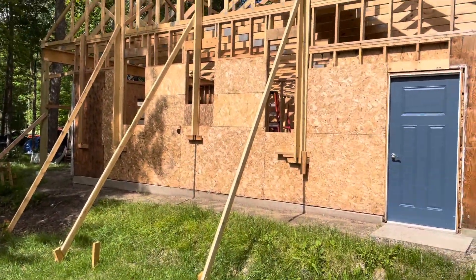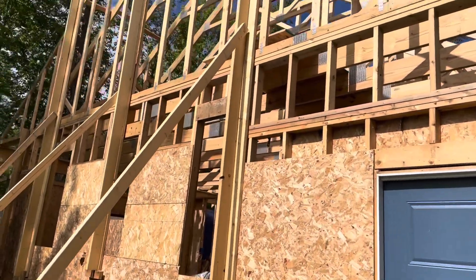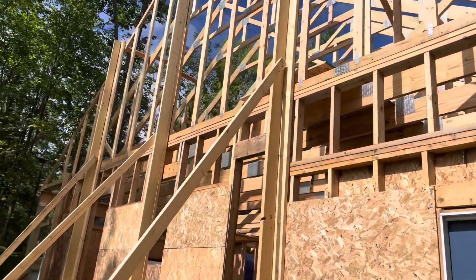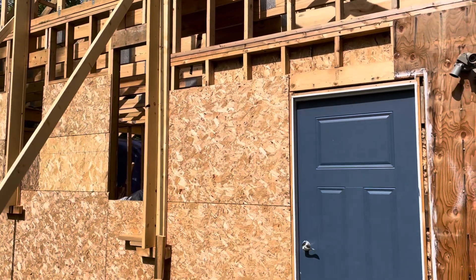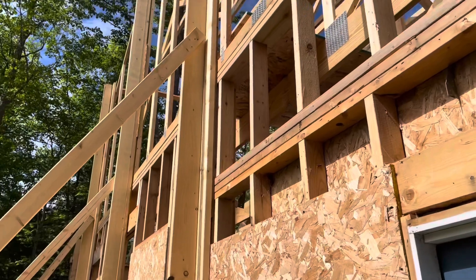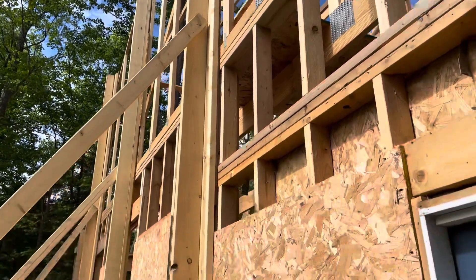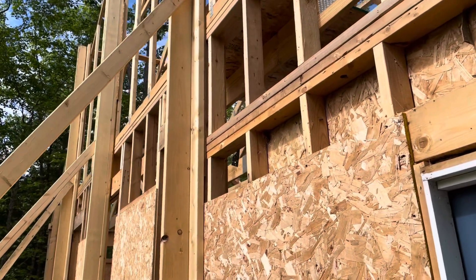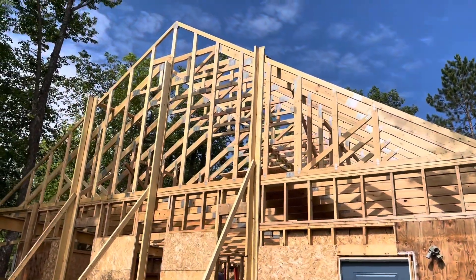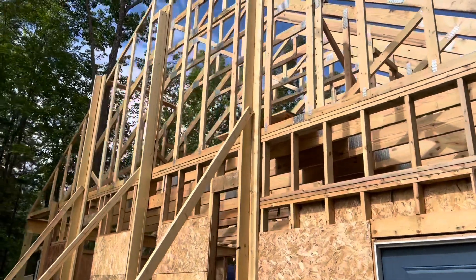Well before we were ready to set the trusses I went ahead and built these strong backs and put them up there. It's two two-by-sixes laid at 90 degrees to each other to give a real stiff support for the first truss that goes up. That gable end truss needs something to rest against because all the other trusses are going to be tied to that one. I did one right in the middle and then a couple about halfway between the middle and the outside edge at the quarter points. When you do lay these up there, you have to sheathe that inside edge — if you don't do it ahead of time you've got to make sure you space it right so you're lining up with your sheathing down below. These trusses have a 37-foot span and are about 13 feet high. The strong backs get anchored to the ground very firmly to support the first truss that goes up.